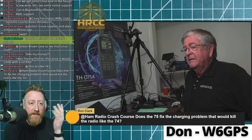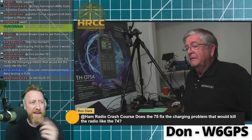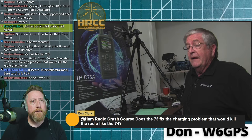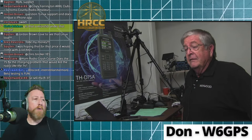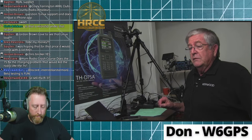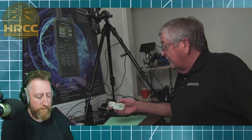Ron's saying, does the 75 fix the charging problem that would kill the radio like the 74? I didn't even know the 74 had a problem. Do you know what that is, Don? Yeah, there was a batch of bad ICs, bad radios. What had happened was people would use their little charging dongle that's only like 300 milliamps, and they would charge the radio, the battery would be dead, and then the power management IC would die.